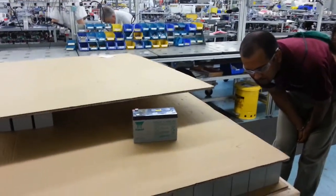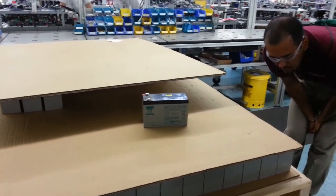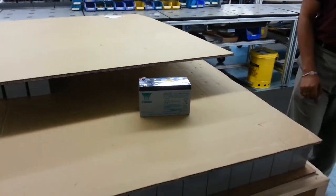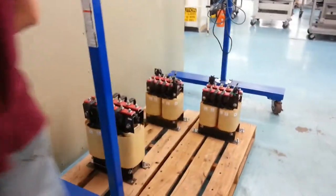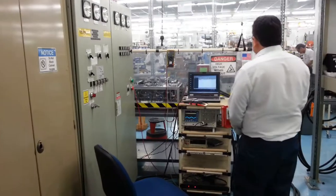That one is 45 amp hour, 12 volts — 45 watts per cell for 10 minutes. And some of our transformers we've got. And let's look at one of our large testers here. We've got testing of the drives, making full road current — the motor is actually outside. And then they have a little cover that gets covered up the first time you put power on it. This one is actually medium voltage rated — 690.